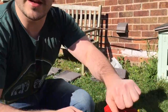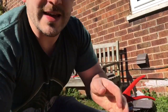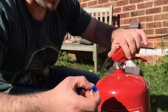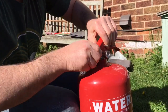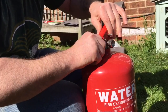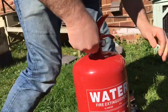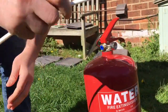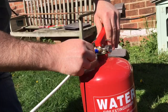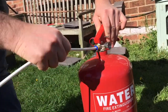Once you've finished filling up the water extinguisher, we're going to re-pressurise the cylinder with air. Untie this hose and unscrew it, then we're going to use this fitting that you can purchase from Amazon. Unscrew this into the orifice and make sure it's very tight because we don't want any air to escape. The next step is to attach our tubing, which you can also buy from Amazon — just straight in and make sure it's nice and tight.